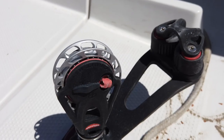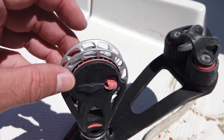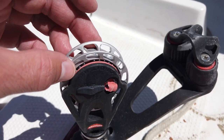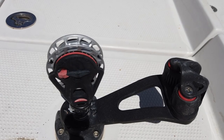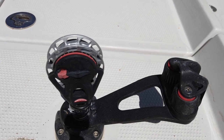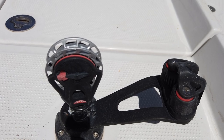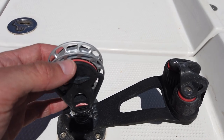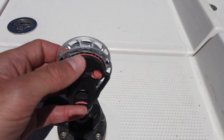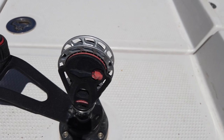Back to easier checkpoints. You have orbit blocks with ball bearings on the mainsail sheet as well as on the gennaker sheets. Wash them all with fresh water and leave them to dry. Lubricate the bearings with Teflon lubricant — a well-known product is One Drop by Harken — but follow what the name suggests: one or two drops are enough. Keep in mind that you need to lubricate the bearings on both sides because they are separated, and don't forget the triple block of the mainsail sheet. It's recommended to repeat this a few times during the season.